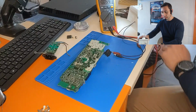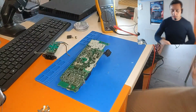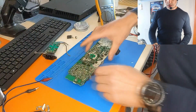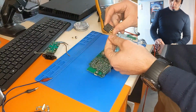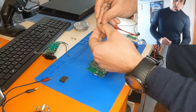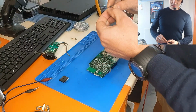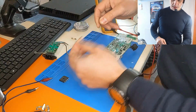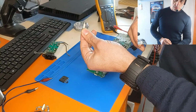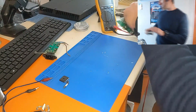But I will show you another problem of the PlayStation 4. So we have to deal with two problems, actually. This was the first one and the toughest one, to fix the power supply. So we actually replaced three components: the bridge rectifier, one small diode. This is from the snubber circuit. It actually controls the returning voltages from the coil, this specific diode, and a simple fuse on the input. That was the problem.